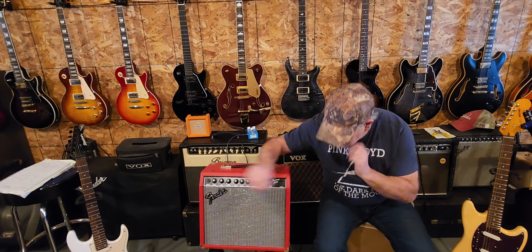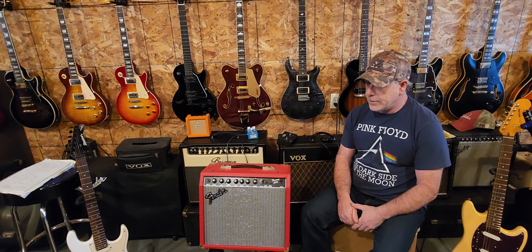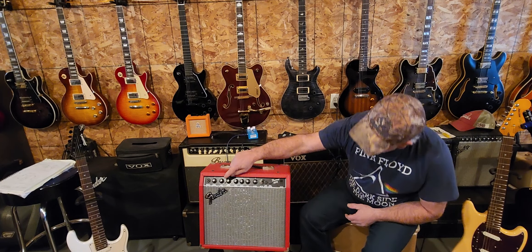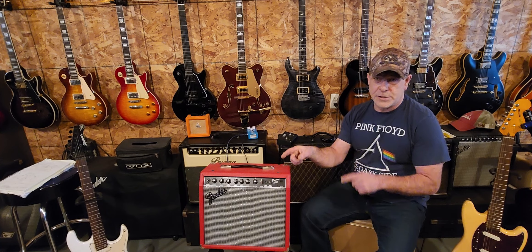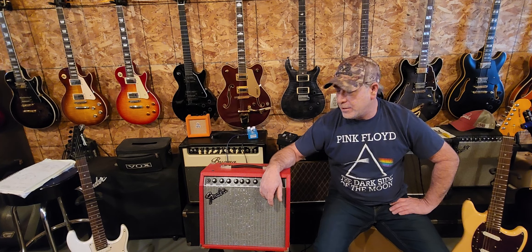I really don't know what I would do with this — maybe gut it out and stuff a little tube amp in there, or a different circuit. Or possibly I may go in there and see if I can figure out the circuit board and change out whatever caps they've got going for the treble. You could change the cap values out and probably make the EQ stack sound better. It's a lot of work for not a lot of amp though — even in my situation where I work on this stuff all the time — so it's really probably not worth doing.